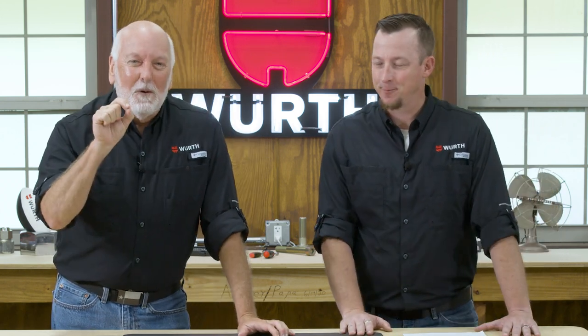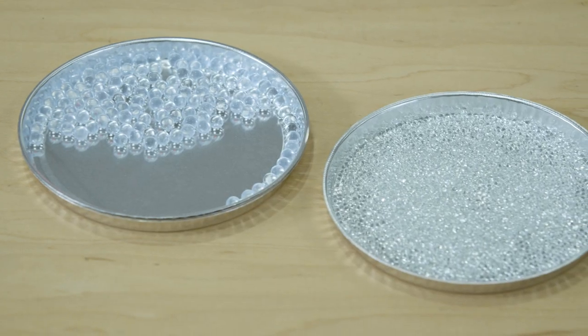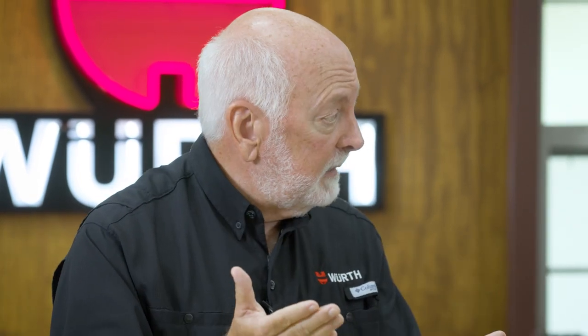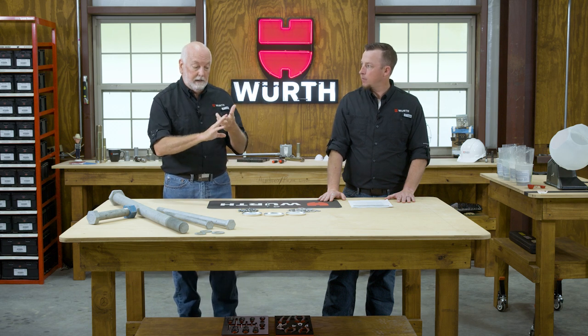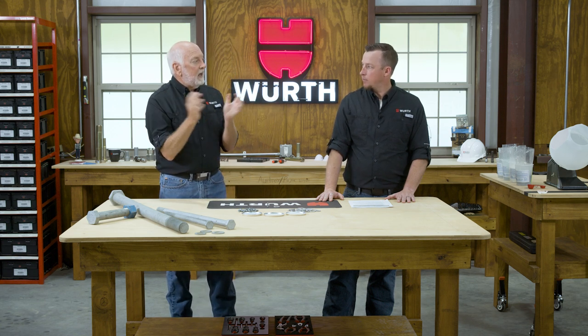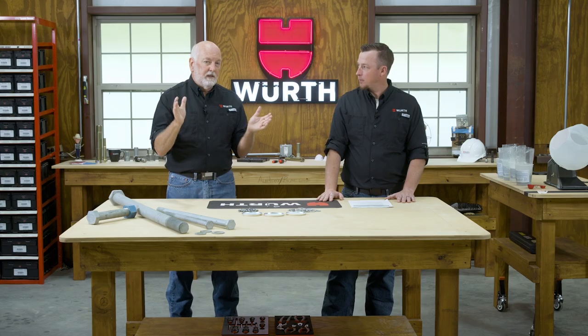No molten zinc, but this will be a good demo. What we do is we take glass beads — round glass beads in different sizes — and we put them in a barrel that looks like a cement mixer. We put the beads in there, we put our materials in there, we put our metallic powders in there. You can do zinc, tin, copper, and aluminum — lots of metallic powders can be used. You tumble it in a water solution with some promoters, and the glass beads peen the metallic powders onto the surface of the fasteners.